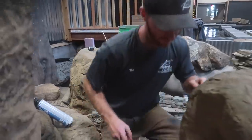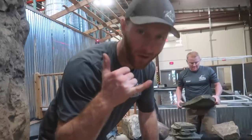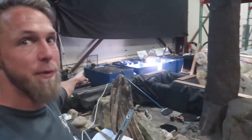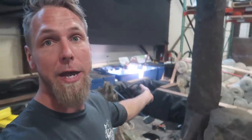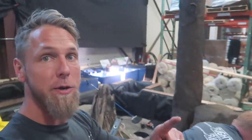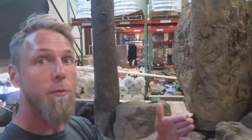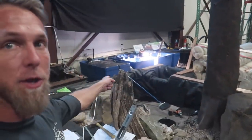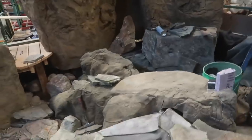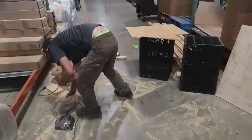Nick looks like you are done, dude — check it off the list! Looks killer, nice job. Brian is making good headway on the slate work. We have this wall built that's going to span all the way across, the skimmer is finished, and the liner is draped up over the top of the weir opening. Next step is putting this long wall — we have the door built in — that's going to go between the tree and the rock. Thirty pieces of slate — you did really good. Slate work is cool but it's super time consuming.